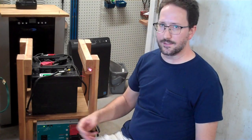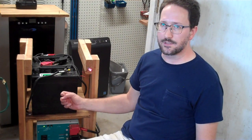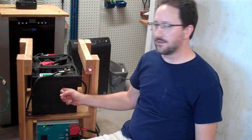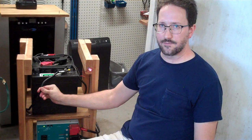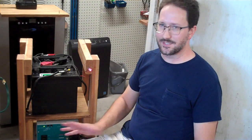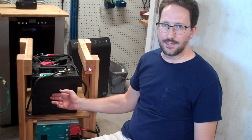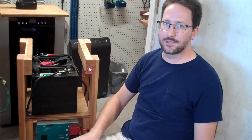These batteries are rated at 75 amps. They can certainly produce 200 amps continuously for a while, but you're hitting the batteries pretty hard. So it'd be nice to go up to a 24-volt system, which reduces the size of the wires you need by half. With lead-acid batteries, though, the 12-volt system is the standard. Another nice feature of the 12-volt system is that when these run down in a hurricane, you can start your car up, put jumper cables from your car battery to these batteries, and charge it using your car's alternator.